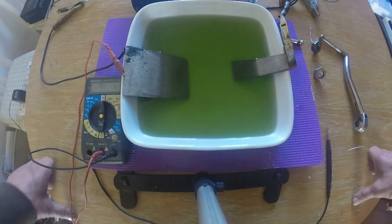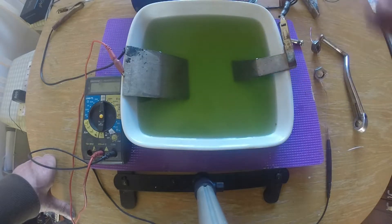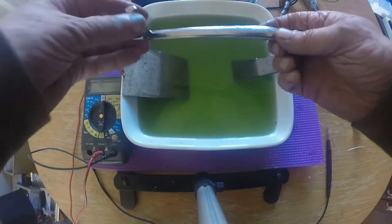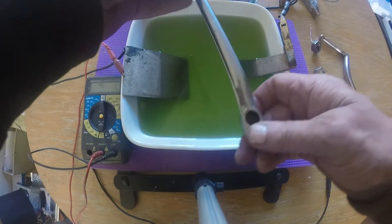Okay, we're back. The electrolyte is nice and green and going nicely — I can see lots of little bubbles coming off the negative side. What I want to do is plate one of the parts. I'm going to re-plate the gear lever because it was very lightly plated — it could have done with more, to be honest. I wanted to make a quick video at the time and stopped it short, gave it a bit of polish, but it could do with a bit more.